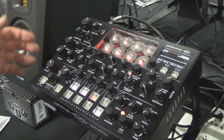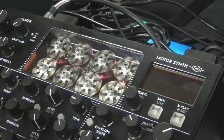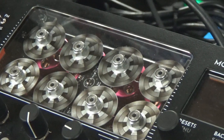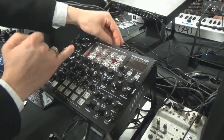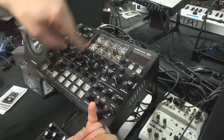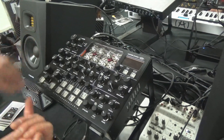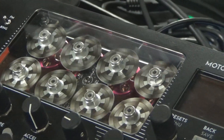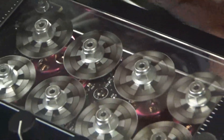So the way those are harvested is kind of interesting. If I turn the thing off, you can see these interesting patterns printed — this is a gradient pattern printed on an aluminum disc. We are bouncing an infrared beam towards the disc and it reflects back into the sensor. The beam is static, and as the disc spins underneath the beam, the darker regions absorb the light and don't bounce it back, while the transparent regions bounce it back. So here we see a graphical representation of a sine wave — it goes gradually from light to dark. And then if you introduce the motion, you can get the wave shape of the sine at a certain frequency. For example, this one in the middle — that's a square wave. So that's how you make analog wave shapes with optical sensors.